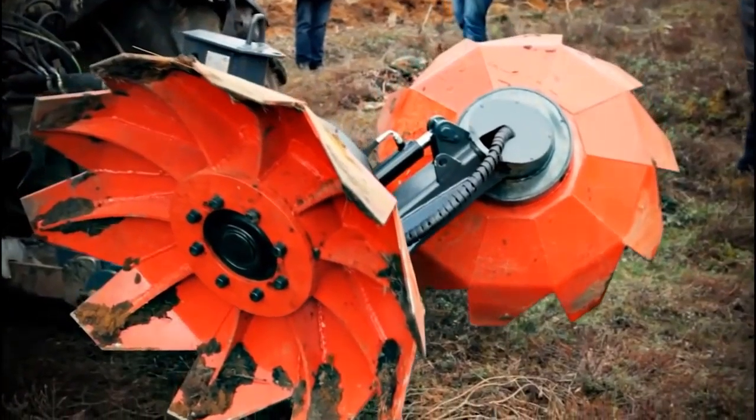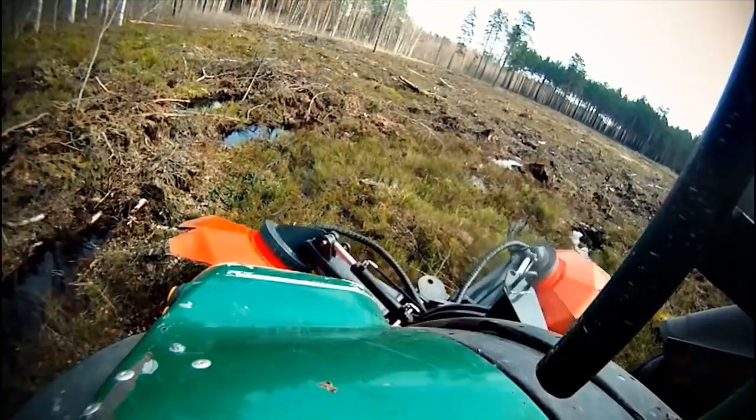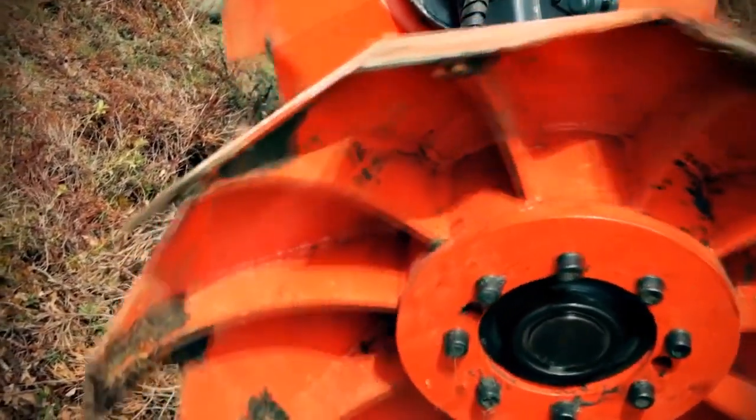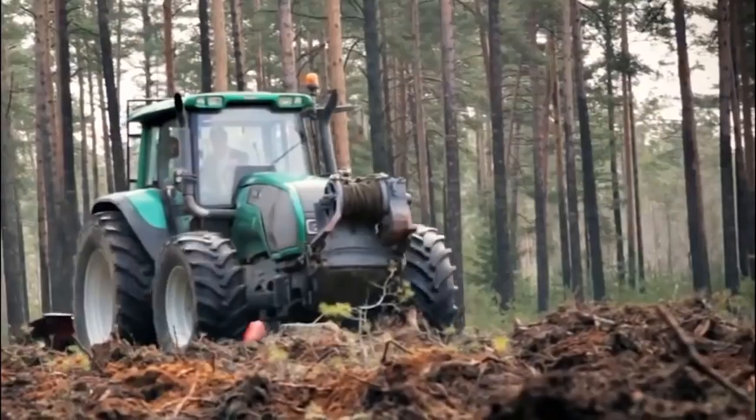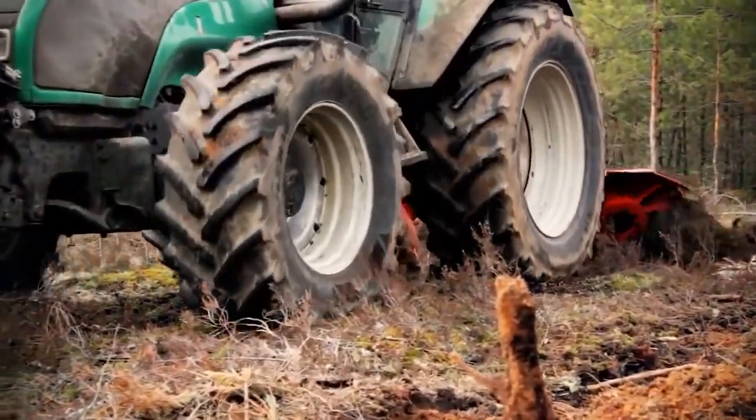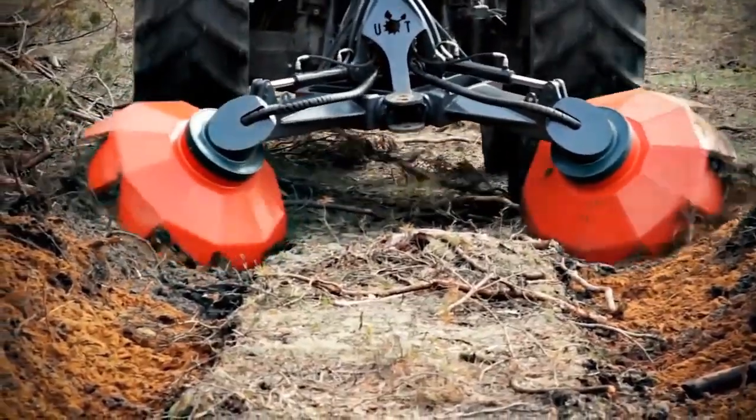The disc trencher is a continuous double-row scarifier. The discs that do the trenching are basically an adaptation of agricultural discs. Trenchers are designated for stripping the soil before the preparation of regenerating the forest or artificial reforestation on heavy weeding or calamity sites.